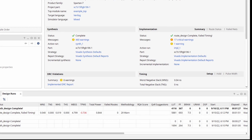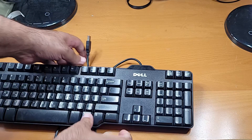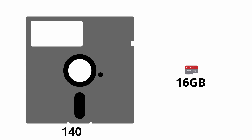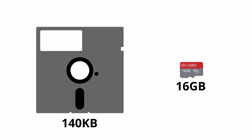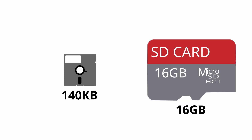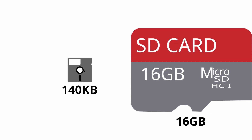Here's the complicated part. I want USB keyboard, USB joystick, and SD card storage. Of the three, controlling an SD card as a block device is the easiest. Sadly, it's not very useful. A typical SD card is 8 to 16 gigabytes, while an Apple II floppy is 140 kilobytes. Storing more than one floppy image on a single SD card is expected, which means we want the SD card to be formatted with a file system.